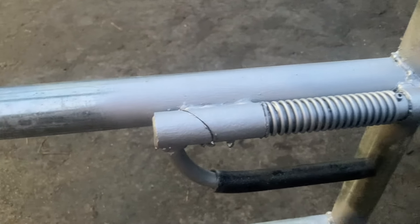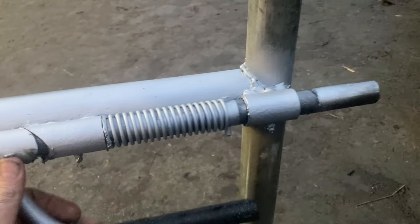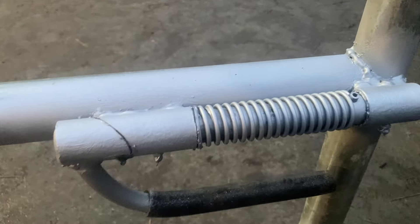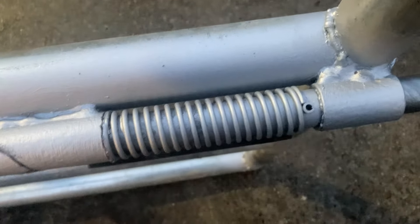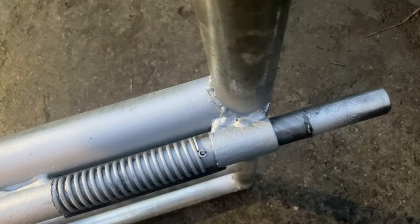Just to show you this bolt I had done on this gate — sort of a copy of the actual bolt that's on the crush unit itself. Just pull it up, it's on a cam. As you pull it up it'll draw back the pin, spring loaded. So just handle it open one-handed, just pull it up and away you go. Should be a good job. All it is is just a 45-degree cut there and it'll cam itself back out. And the spring here is 25mm — it's actual shafting.